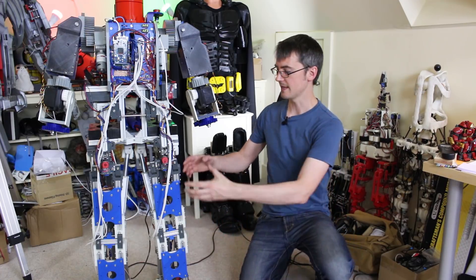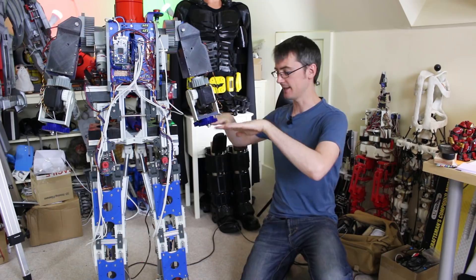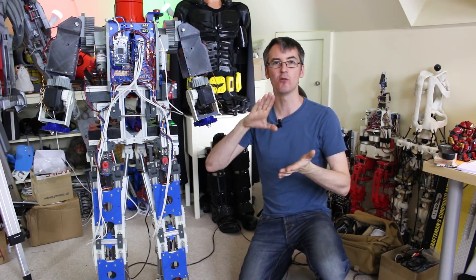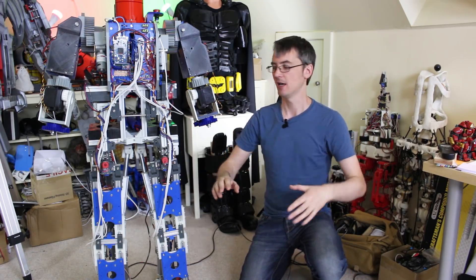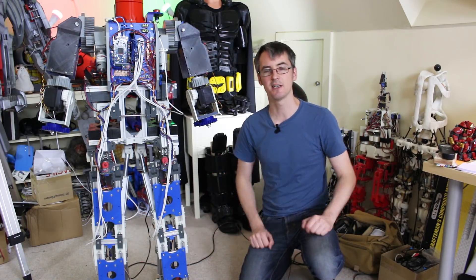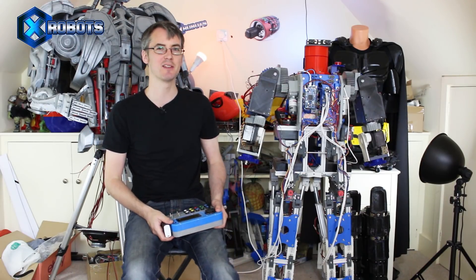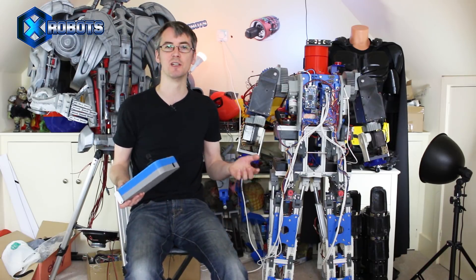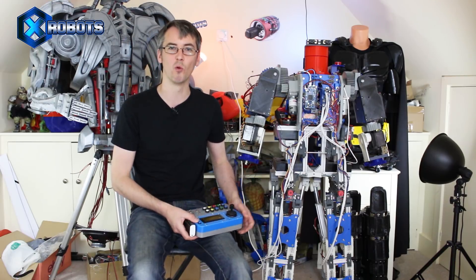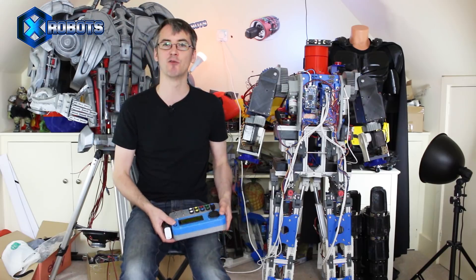What I was going to do was use the inertial measurement unit in each leg along with the foot pressure to alter the ankle tip, so we could try and keep equal pressure on the ground at all times with both feet. But actually it doesn't look like I need to do that, though I have got those four sensors so it is something we could do in the future. I was going to try and make it walk with those foot pressure sensors, but I don't think it's going to work any better than before. Also, my code has now become so convoluted I don't think I can easily do it. I am going to publish code from when it did walk before, but without the pressure sensors, and also the code as it is now for all of the things.